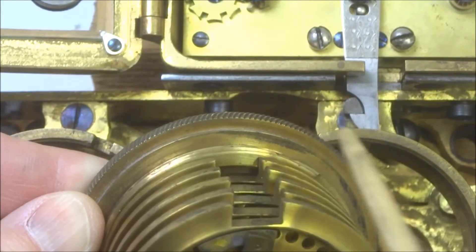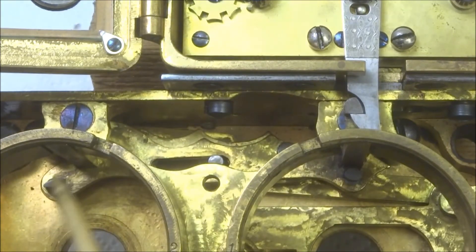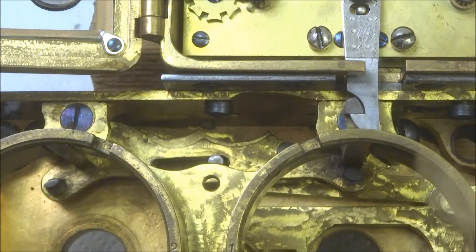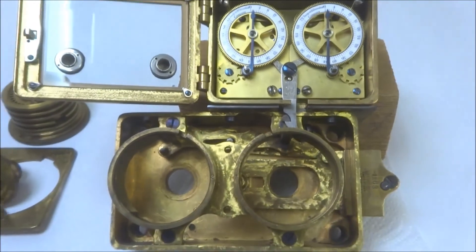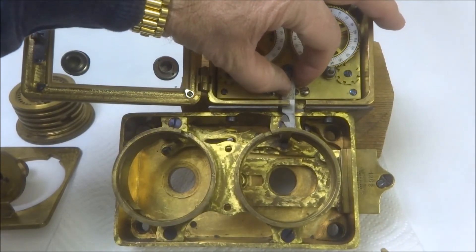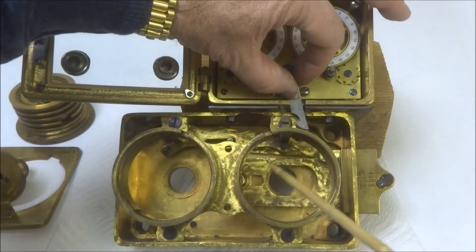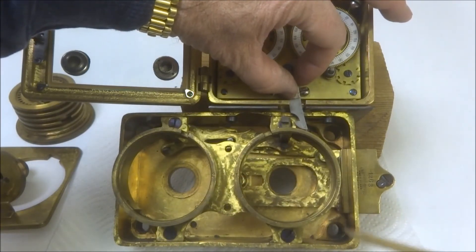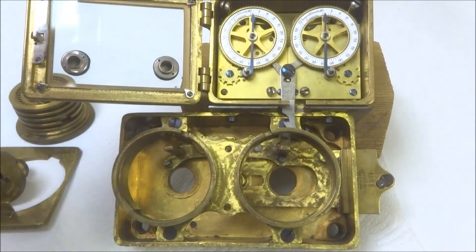When this fence here can fall into this area, the combination lock can be dialed in properly. In other words, when it falls in, the combination lock has been dialed in, and both of these allow the fence to drop and the safe can be opened. So basically when this goes to zero, it will pull this back like so.